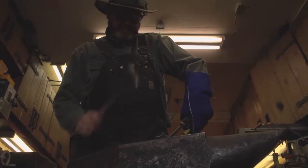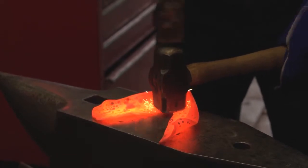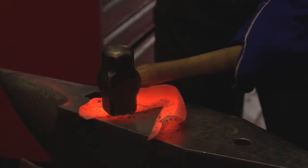Then I'm decorating the sides a little bit. First I flatten down the angle so it will hold flat against the wall. Then I twist and shape the part that's going to be up against the wall. Right at the end I do a little curl on one of the corners, and what I'm really going for is a flowing metal — so that it flows around and looks more liquidy than metallic when you're done. That's where the artistry comes in: getting that manipulation to happen so it really comes together and produces something worth looking at. The very last stage is to flatten it out so it will sit flat against the wall.